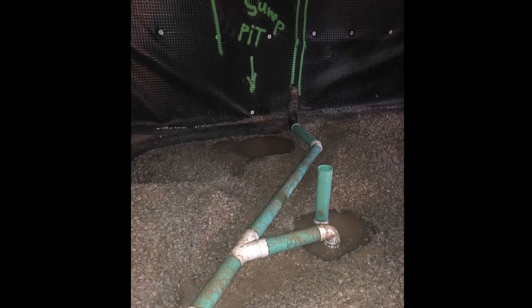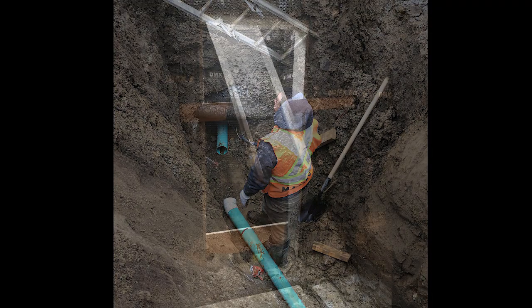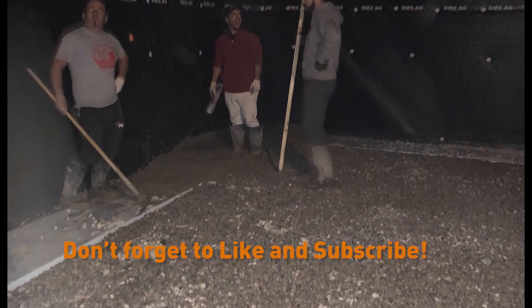Previously we finished the framing for our main and second floor and gave you a walkthrough of our new space. We also shared how we installed the basement drains, connected them to the city's sewage system, and poured the concrete basement slab. The next stage was to spray foam the concrete basement foundation walls for some continuous insulation throughout, and then frame the exterior walls. So let's take you there.